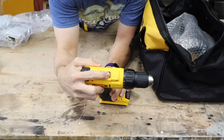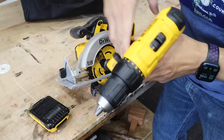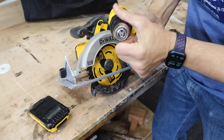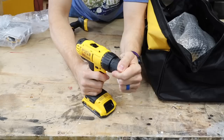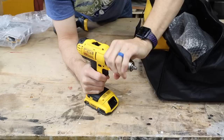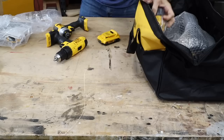You've got positions one and two on top of the drill — don't switch it while you're drilling. And then of course you can adjust the power of the drill. If you've got it set on a lower number, when it reaches a certain tightness or resistance, it'll just start popping — you hear that grind and it'll slip. The more you turn it up, the more tension will be required before that happens. If you turn it to drill, that bad boy is just going to go. So far so good.